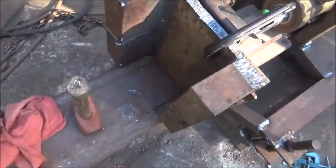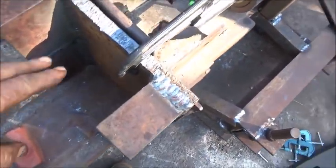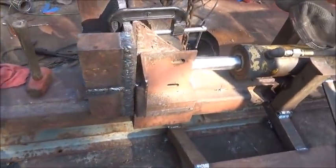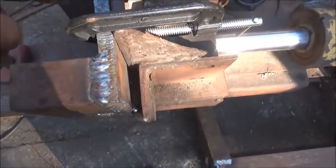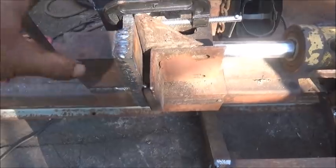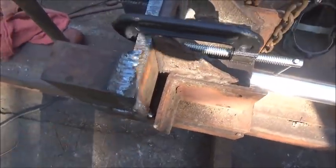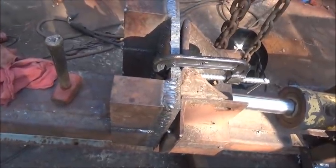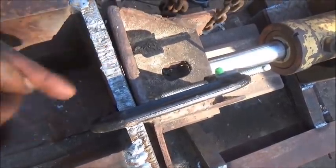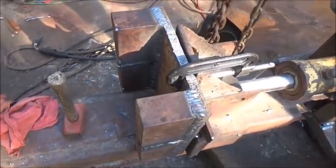I'm working on the piece for here. We just got to do some locating, raise it up a little bit, do a little grinding, a little cleanup. But it's welded up in there, 3/4 inch plate. Now, it's not going to be touching on the sides. And it may bend that plate, but if it does, it's just going to bend it back to where our other plate's already at. So it's not going to be a big issue. We'll pin it from the inside, and then we'll have one bolt through it. And then we'll be able to take that off if we want to split wood.